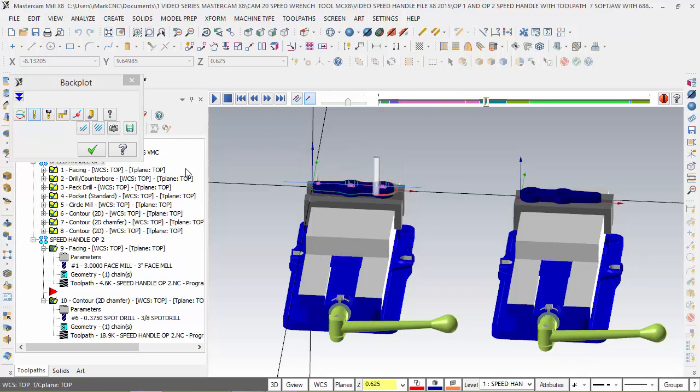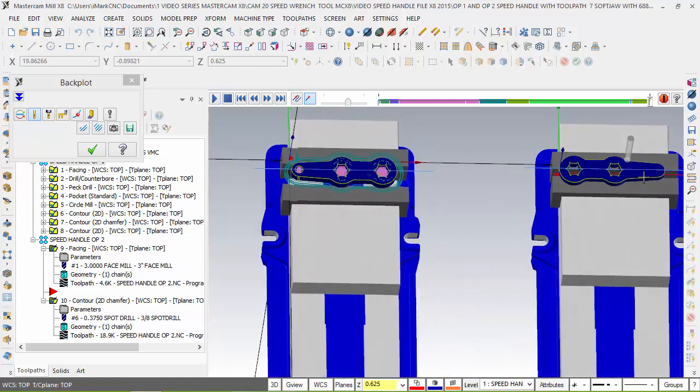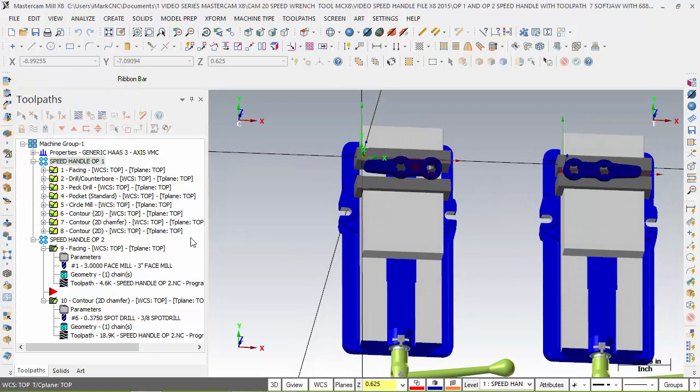You do the whole process of it. And this is more for production, just to show you. I'll explain this more in class, but I wanted you to see that if I have my environment drawn out, it's doing the other part too, using only one work offset, which is G54, my world coordinate system. All I have to do is cut the vises to match that, put them in there, and I'm doing production. And if you want to see this, I'll do this a little bit more advanced.